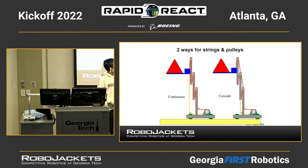And on the right side, that's cascade, which means there are separate strings that only chain between the adjacent stages. So only between the first stage and the second stage, then the second stage with the third stage, then the third stage with the carrier. I would say the cascade way would be faster, because you only need to pull the string the length of the height of a single stage, but with the continuous one, you have to pull double or triple the length that you would need for the cascade way.